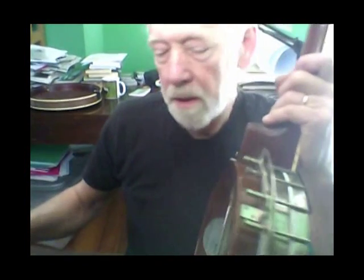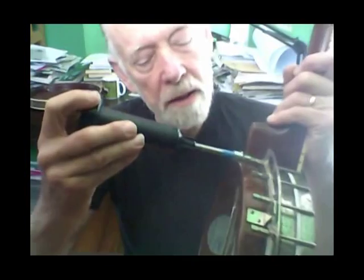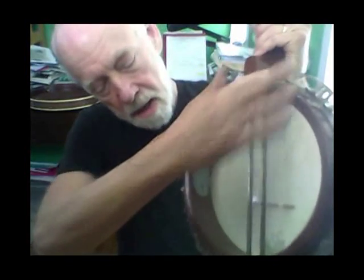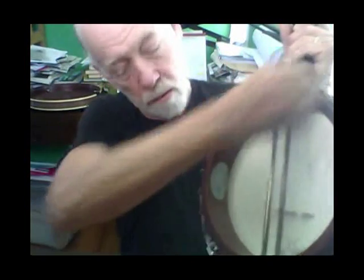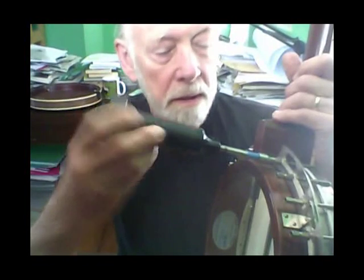I'm systematically tightening the nuts with the torque wrench, adjusting them in sequence so that we do it evenly. I'll start with this nut, then do this one, this one, and this one, going around to bring it up in a systematic way. It's analogous to torquing the head on an engine, if you've done that. I'm setting them all right now to 10 kilogram centimeters, which are the units this tool uses, and we'll see where we are.